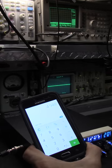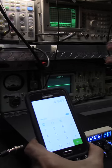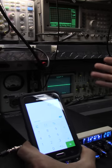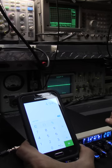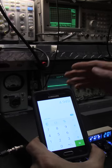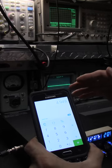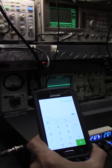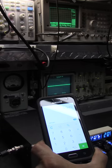That's the usable power at the fundamental frequency, 3 kilohertz either side of it, from splattering. And the peaks and the frequency response is your amplitude sound quality. But that is your power. If they can't show you this, they have some screwed up scales, okay?